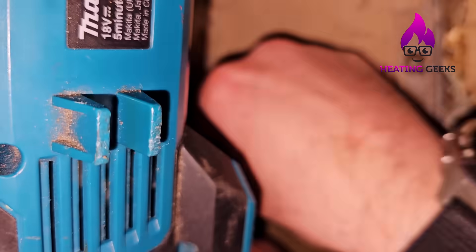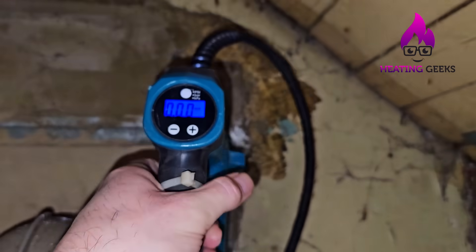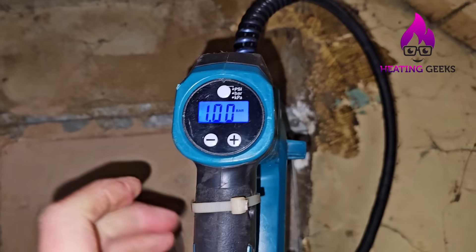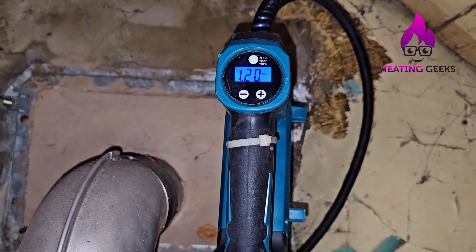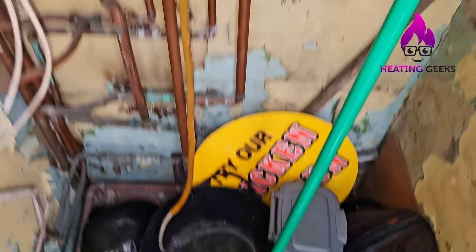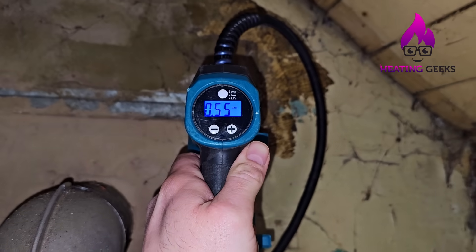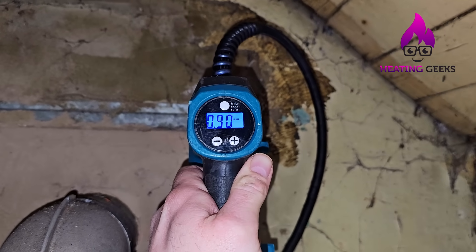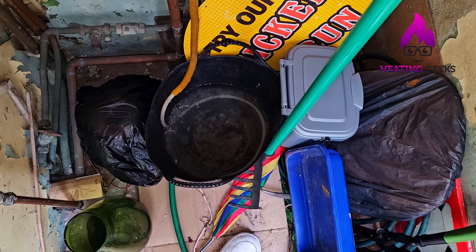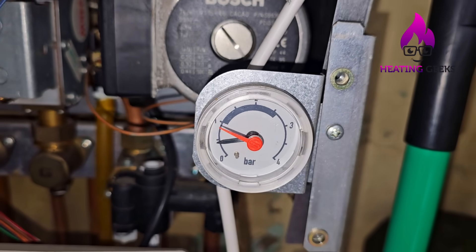Got the pump connected and we are showing zero. That's pumped up — as the water leaves, the pressure may go down. The water is leaving the vessel; that's where you need the open drain point. We're down to half a bar. The bucket's filling up. The pressure gauge has gone up because we're compressing all that air in the vessel and the water hasn't left the boiler quickly enough.